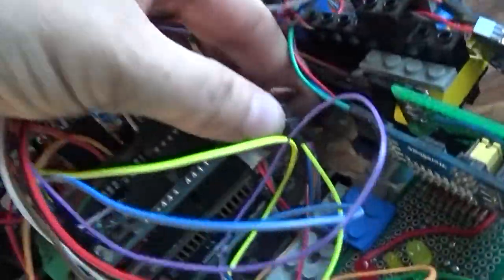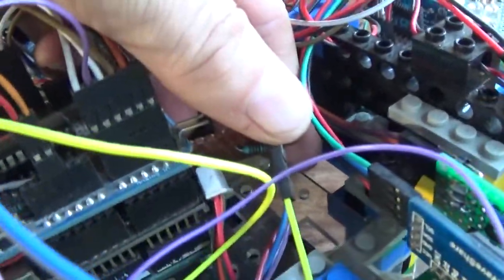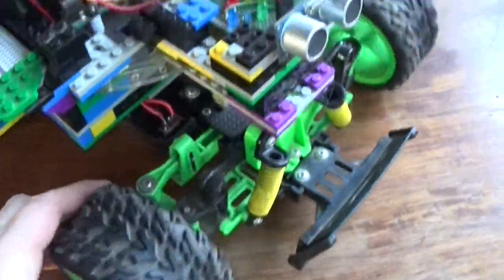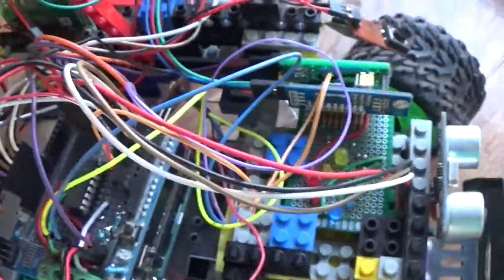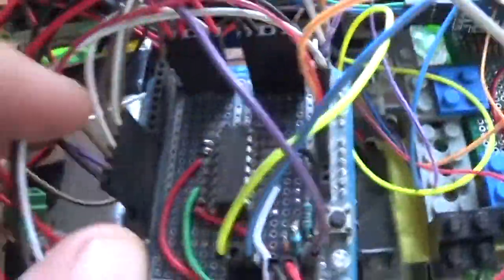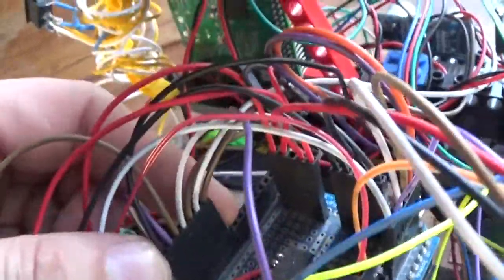Now this one has a different setup. I had to create a voltage divider and then some programming so that the Arduino would know the current status of the wheels — if it's left, middle, or right. And it has its own battery pack. I'm using an energy shield, so this is Arduino Uno, the battery pack, and then my special board. I made this myself — it is the H-bridge that controls the tires. I've already soldered them to the first set of seven pins.